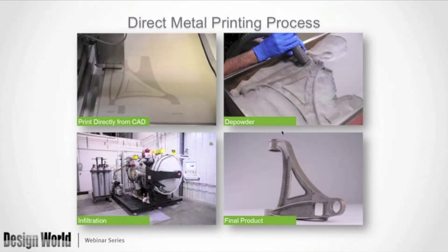This is our direct metal printing process. Basically, we'll be laying down a binder across a powdered metal bed, what we pull directly from CAD. Our direct metal printing process basically stacks up layers of material, so we'll spread powders. Depending on certain size powders, we'll spread it at different layers, and we'll jet a binder. Once the binder is done, we'll spread powders across the print bed again, and then jet a binder again, basically stacking that part up throughout the STL file. We'll put it in, and then after cure is depowdering.